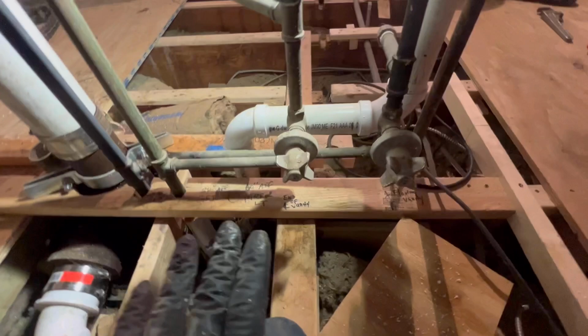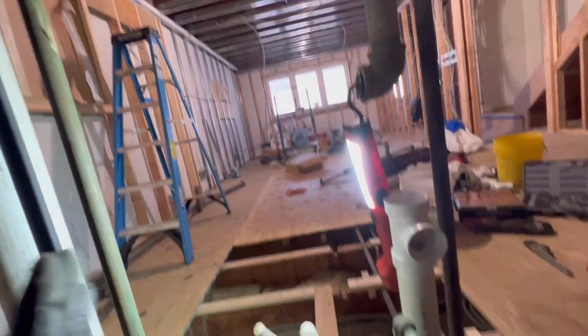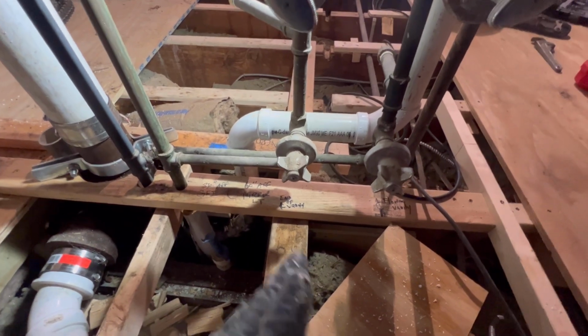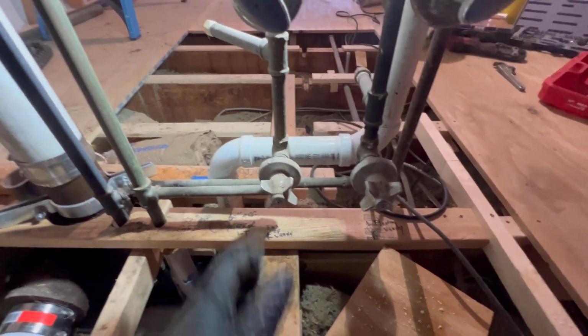So a lot of 2-inch. Guys, when you're roughing in the bathroom, do all 2-inch. Never use 1.5. You can, but I mean, all 2-inch, even for the venting, guys. 2-inch, bigger the better. That's what she said, guys. Let's do this vent up here and let's just continue. But that's what we got done so far. We're gonna cut these out right now anyway, so get these out of the way.